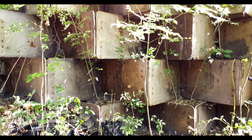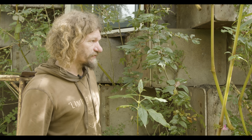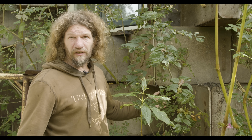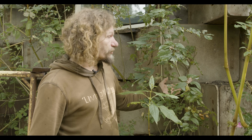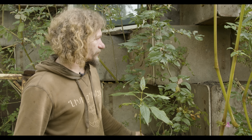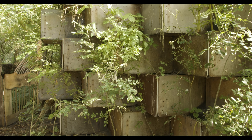For those who want to try it themselves, the planters need to be big enough — this wall I haven't had to water in two years and it's still growing well because the planters are a meter wide, 50 centimeters deep, and 50 high. The material you use needs to be at least 10 to 15 years structurally sound — you can use thick oak or acacia. For my next house I'd like to use degradable materials so that when the trees support the house after 10 to 15 years, the planters get eaten by the tree and you have a house fully made of tree roots and earth.